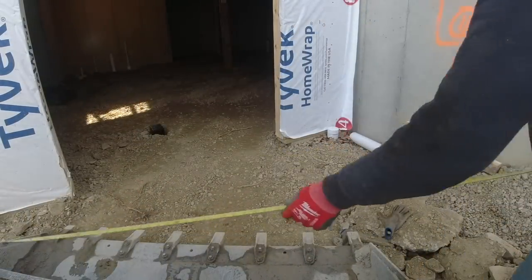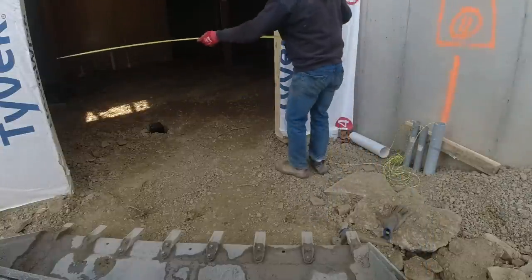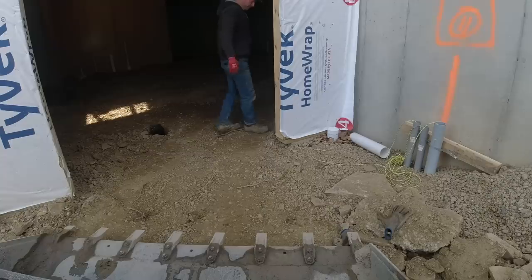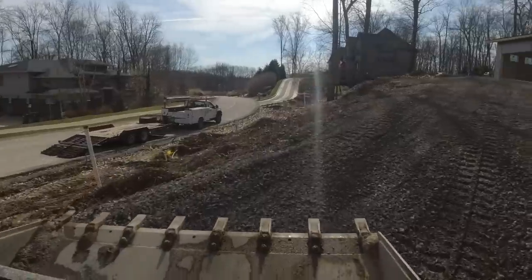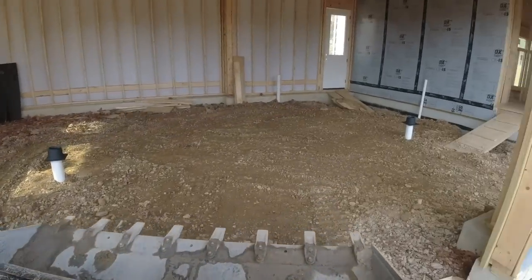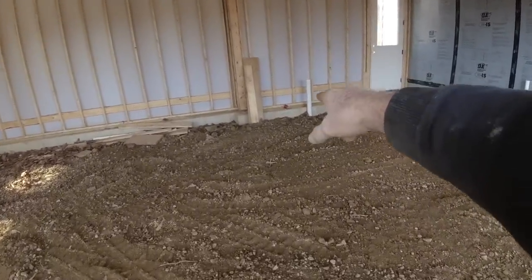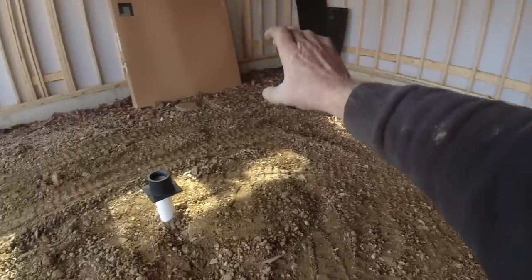Well, this could be a problem. My bucket is 73 and a half inches. 72, 72. Okay, so I can work up here in the garage. Top of wall is bottom of concrete. So I need a good foot of stone — 8 inches, 8 inches, 10 inches.